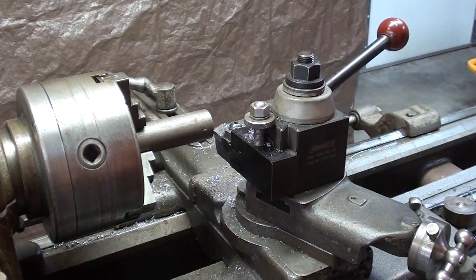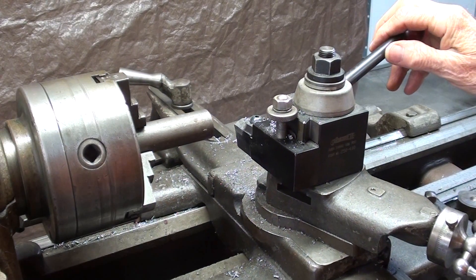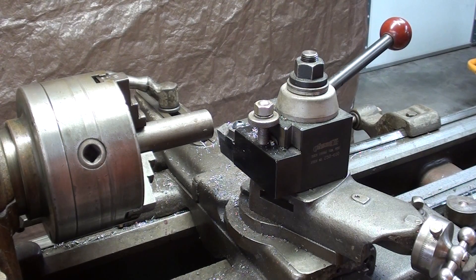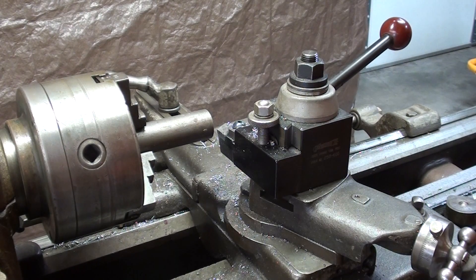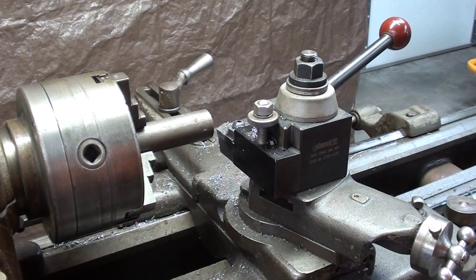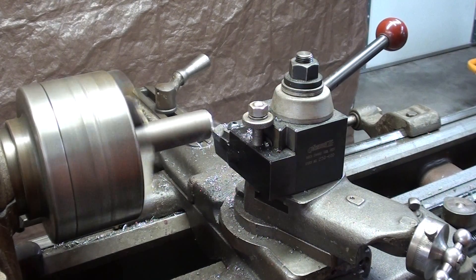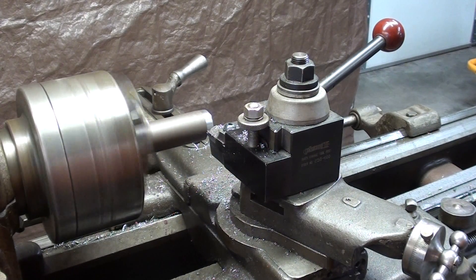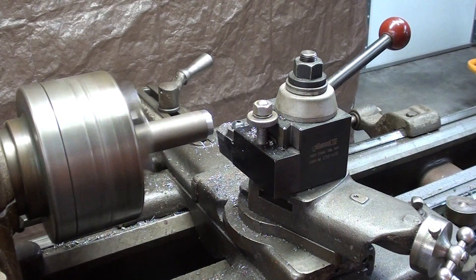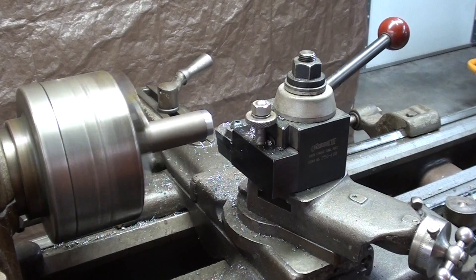As I get ready to make my first cut, before each cut make sure you back the carriage out considerably and then back in — that removes any backlash or lost motion from the entire mechanism. I'm going to take a light cut, just a trial scratch cut. I will feed in and tighten the binding screw. You'll see it will not cut very long before the taper runs out, so I will loosen the clutch, come in, loosen, feed, tighten, and turn the clutch for my second cut.